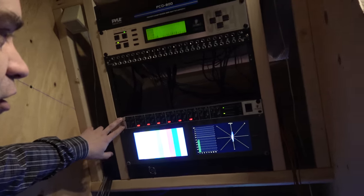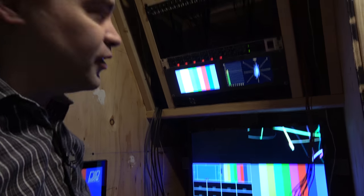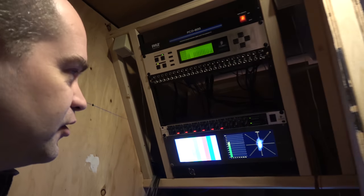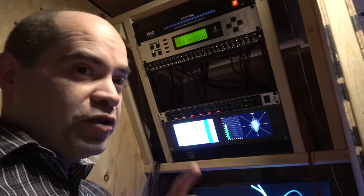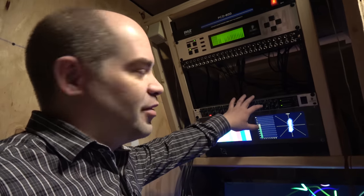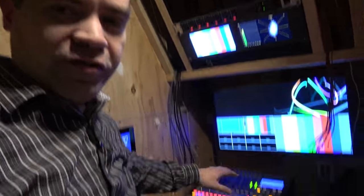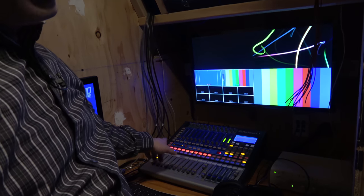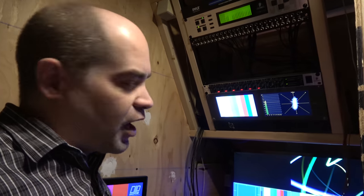That's one of the main reasons I got the Behringer compressor years ago — it does a great job of handling transients that come your way when the audio guy is either afraid of compressors or doesn't know how to use them. This mixer is really only connected to the speakers here in the audio booth. Its output doesn't go anywhere else — not to the switcher, not to any other speakers. On channels 15 and 16, I have the output of the switcher itself, so I can hear exactly what's going out live. If there's any distortion on the final output I'll be able to hear that. On channels 13 and 14 is the control room output from the mixer.